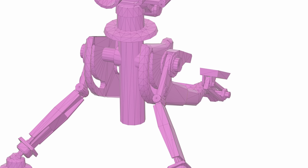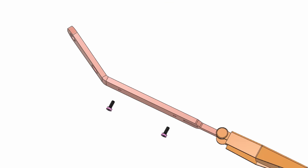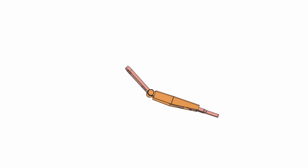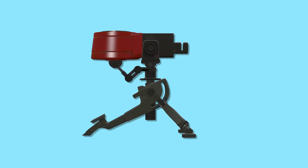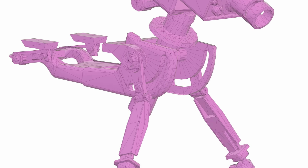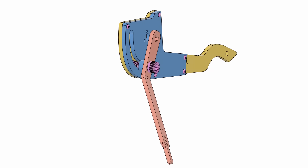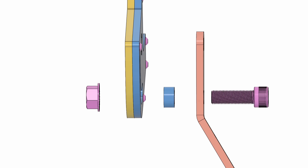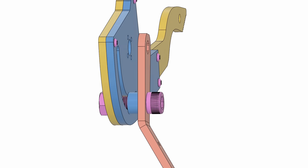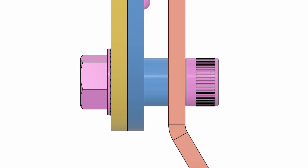But the legs aren't done yet. There's no simple way to have the little knee hinge locked at the correct angle without a lot of fuss, so I simplified it from a hinge to a permanent bend at the correct 45 degree angle. I added some round elements to the lower leg cover to mimic the hinge design, which doesn't really make sense, but just don't look at it too closely. Now, the front legs have what I would consider a major flaw. The hind legs in all of the sentries have distinct slots for adjusting their angle — but there's nothing modeled in the legs to ride in the slot. Minor graphical oversight or major modeling malfunction. It drives me crazy that there's nothing there, so I fixed it with a comically large screw, spacer, and nut that mechanically do nothing to support the legs in my build. But aesthetically, spiritually, this screw holds the entire build together and gives me inner peace.